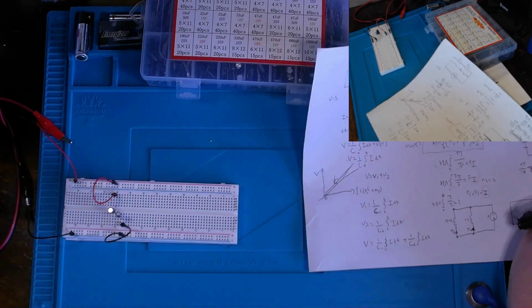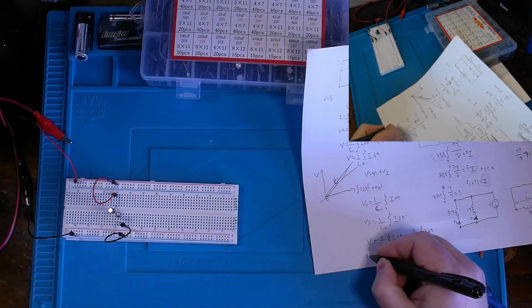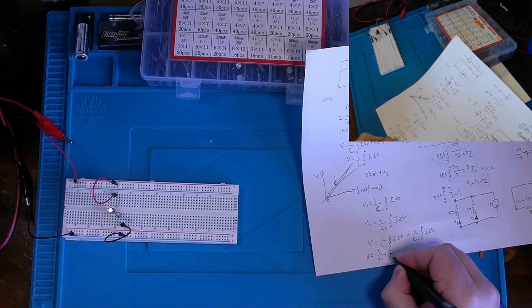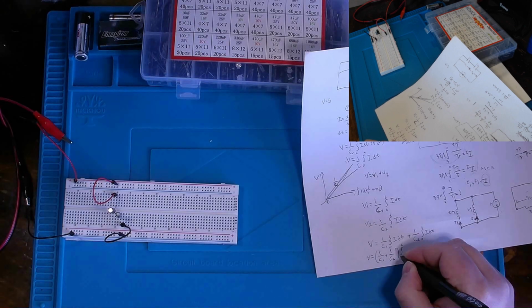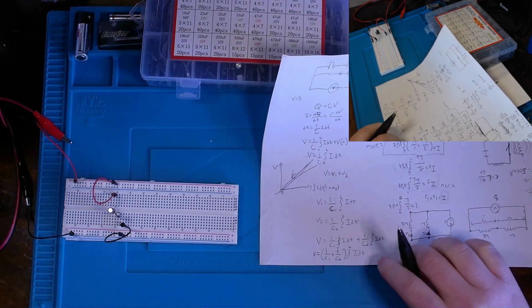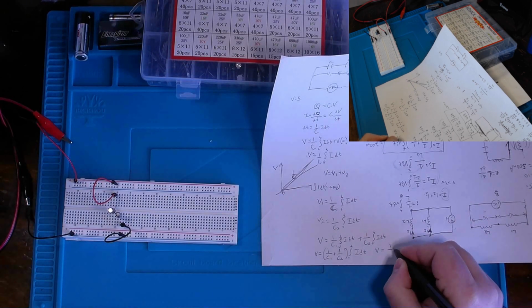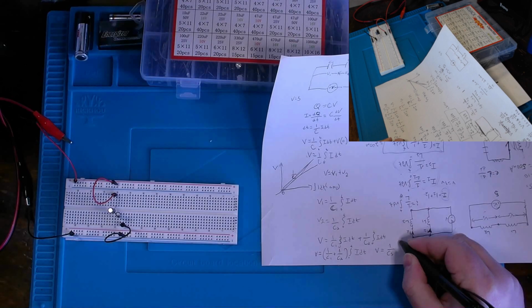Well, we can essentially rewrite this as, let's see, V equals 1/C1 plus 1/C2 in parentheses, pull out our integral of I dt. So essentially we could rewrite it as that, or V equals the sum 1 over our capacitance sum, and then looking at our integral I dt,